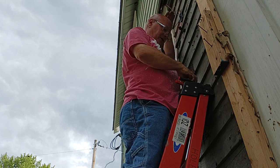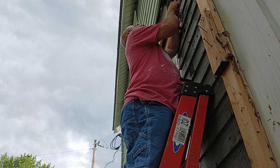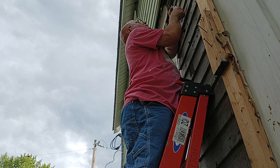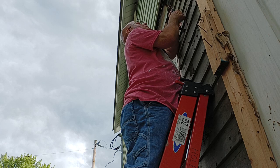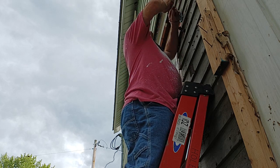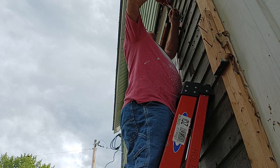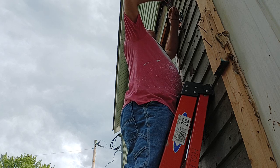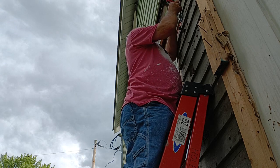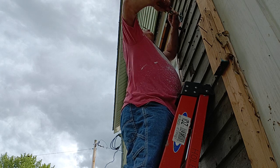Now we'll get our blacks and whites ready here. Okay, so we'll get our insulation even at the bottom like this. We'll twist them so they're nice and even on the end here. We'll do the same with our two black wires. Twist them so they're even.